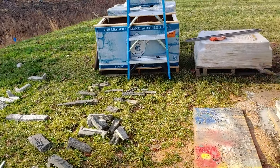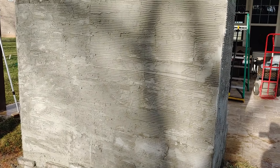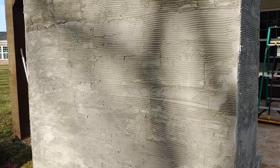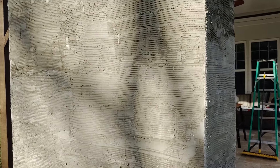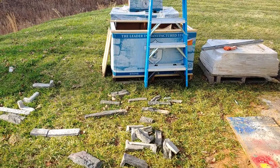The thing to do was mix up some mortar with a little bit of grout mortar — like you're going to do tile — just a little bit. That gave it about the right consistency for it to stick. Then you run a trowel over it and that's going to rough up the surface, which gives the block something to attach to and hold on to. This is still wet and we'll let it dry overnight. Tomorrow we should be ready to go ahead and start laying all of the veneer.